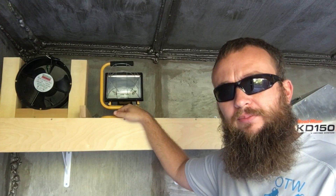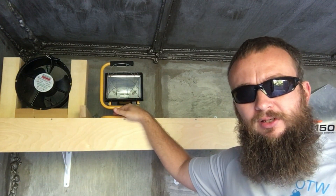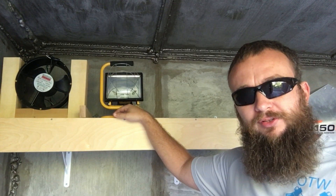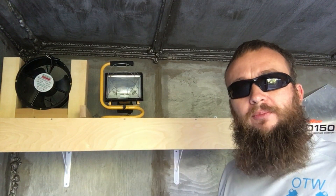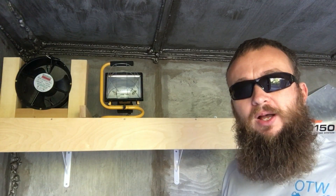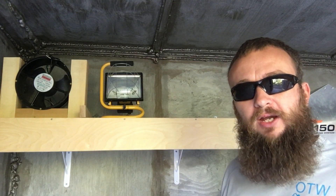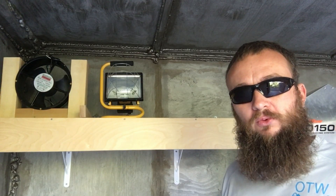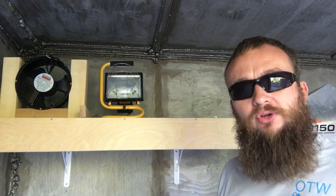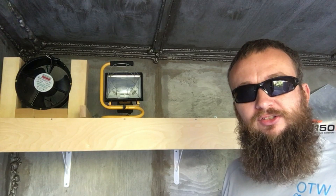On both shelves on both sides of the kiln are the same components, so we'll just go over one side. This is a weatherproof heat lamp and it's 500 watts. These are really inexpensive — I got these at Home Depot for $20 a piece, low amperage, maybe one amp to run them. These lamps serve two functions in this kiln. On your initial startup, when you first turn the kiln on with lumber inside the chamber, you want to get that temperature up pretty fast so you can turn the compressor on and start pulling out that water.